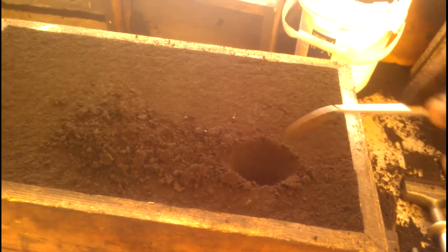Now we need to carve a little basin in here — it's an awful small hole to try to hit, so we want to open this up a bit. That way it's harder to miss the target when you're pouring the metal. You want to avoid any swirls — try to pour it straight in the hole and keep it flowing until the mold is full and then stop. You don't want to start and stop because metal could freeze off in thin sections.